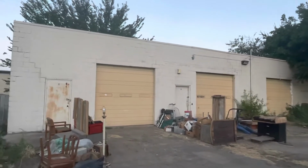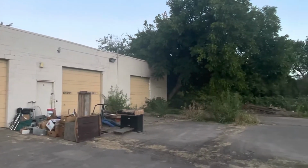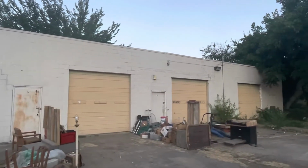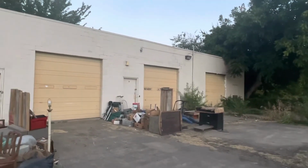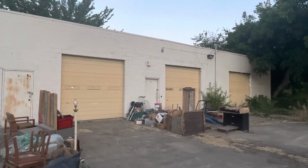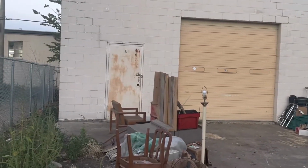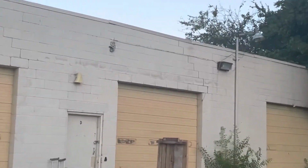And things like that. But the paint on the brick and the paint on those doors definitely will be there for a long time. This building won't need to be painted again, with the exception of cracks, depending on what you're going to do with the cracks, and then primer on that door and that door and that hole. Other than that, just painting it all 2 coats with a wash down will suffice. Again, if you just paint it 2 coats, Sherwin-Williams exterior super paint, no primer, it's still going to look great for years, with the exception of areas like this where there's rust on doors and rust on these lintels, and then the cracks, of course.